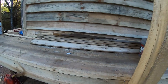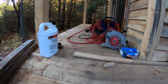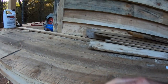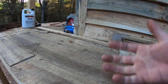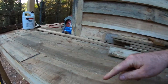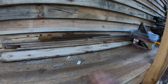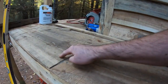I built this deck — basically a walkway that takes you out to the porch. When I secured these boards down they were green, and I think this is inch-and-a-quarter lumber by five inches wide. If I were to secure it like a typical dried deck board, I would probably put two screws — one here and one here — then move down to the next floor joist, one here and one here. However, for this board you'll notice there's only one screw in the center at every joist.